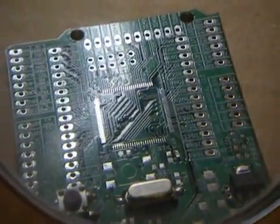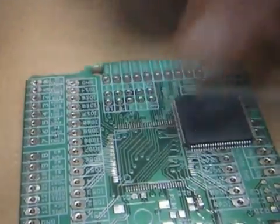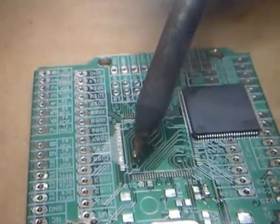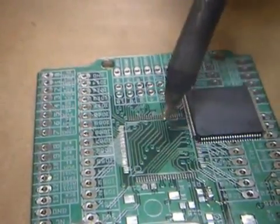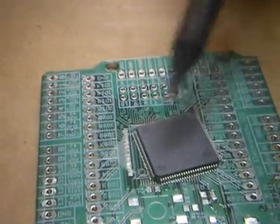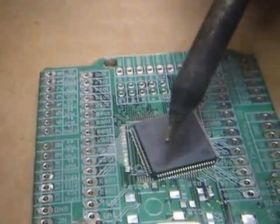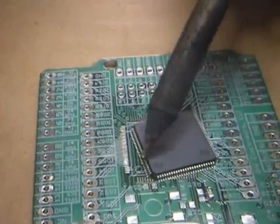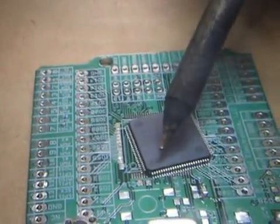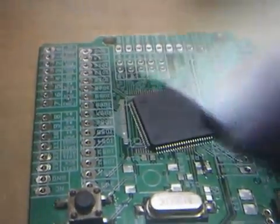So how do you place this chip on? I grabbed one of the USB-EZ chips and now we need to make sure the orientation is correct. See the circle on the board? This is how you know where pin 1 is. We need to do the same on the chip. If you look on the chip, there are three circles. This one looks a little bit different — so this is pin 1. Usually there's only one circle or one little hole on the board, and this chip happened to have three. So this is probably pin number 1 and this is the right orientation.